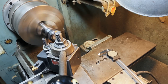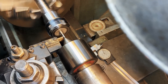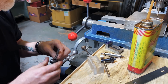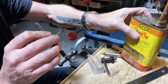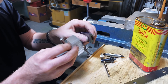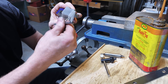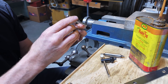Turning it down on my lathe. I've placed the lathe in exactly a position that you can't see what's happening — oh, there we go. A little tiny cutoff wheel. Here's me drilling out the mounting holes for the thread carrier for the vise. Now I'm adding some cooling fluid so I can tap those two holes. And that is a little tapping block I made on Tested a few weeks ago, made of acrylic. It just makes sure that I'm tapping perfectly perpendicularly to the hole.